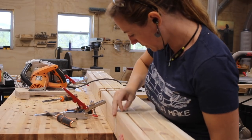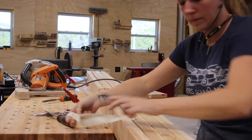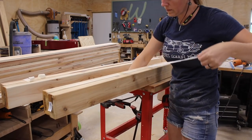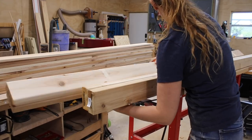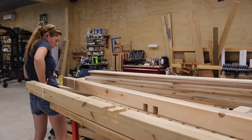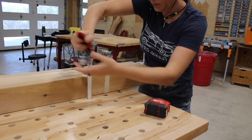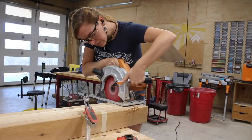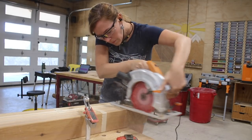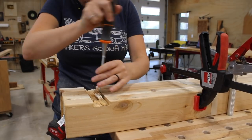While working on these base pieces, I cut in the notches that will later rest on top of the benches. The important thing here is not all four are identical — two are on the same side as the half lap direction, but the other two are opposite. So after untaping the bundle of four, I re-taped them into pairs, making sure to flip one of the bundles so the half laps were opposing one another. Then I made my marks and used my saw to cut out these notches.